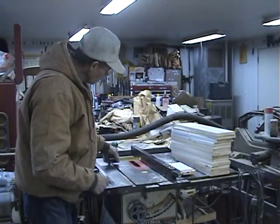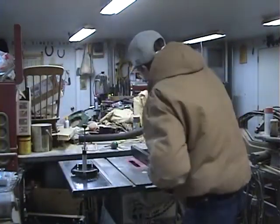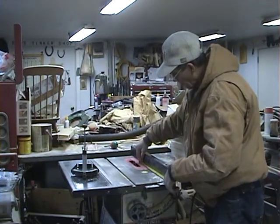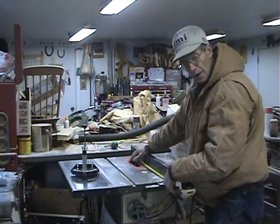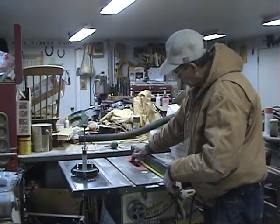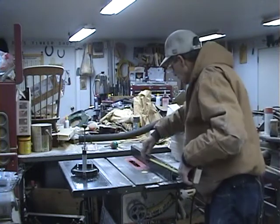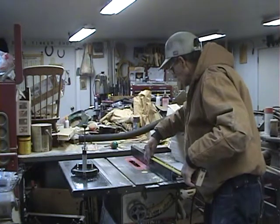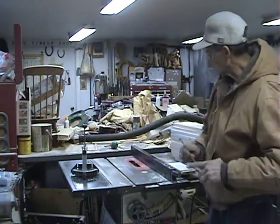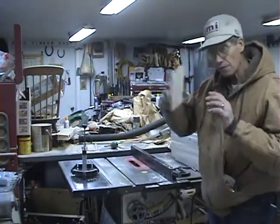You get it over there, you measure from your fence and make it two inches. Then you come back to the dead center of your blade, which would be the bolt going through. This particular one is an eight-inch wobble blade — if you've got a bigger wobble blade the measure would be smaller. But you measure from the center: eleven inches puts a mark on your fence, and measure about two and five-eighths from that mark towards the front of the saw. Take a square and square them down so you can see them.